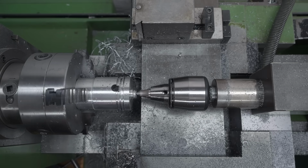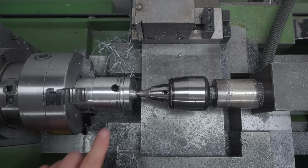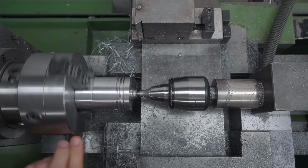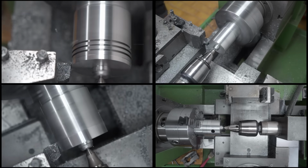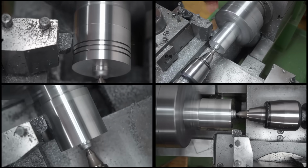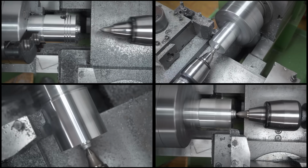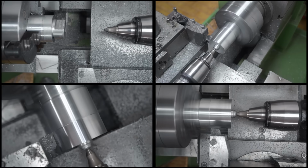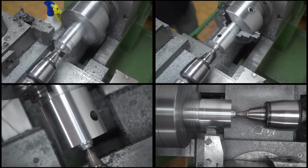Okay, well, that had been working properly, but my guess is it's now got really blunt. So I need to resharpen that tool, because that made a hell of a mess, scrapping one of my pistons. Bugger. After this, to prevent any further damage to that high-speed steel cut-off blade, I dropped the RPM for that operation a bit, and also re-honed the cutting edge after every single piston.